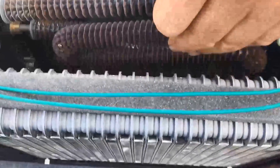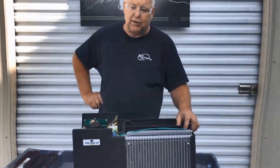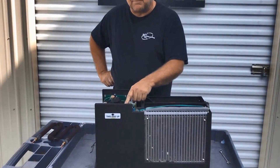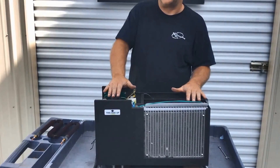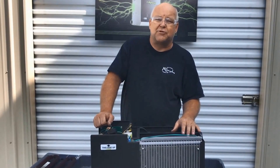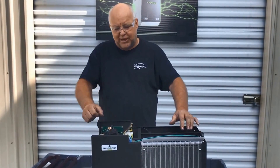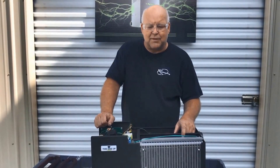This switch will open the circuit at 34 degrees and close again at around 38 degrees. It just keeps ice off the evaporator and keeps gas coming back to the compressor — not liquid. It has shown that it's cured a lot of the compressor problems. Thanks for viewing — be sure to like and subscribe to the Dynasys YouTube channel.